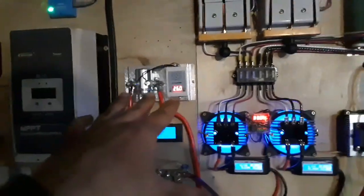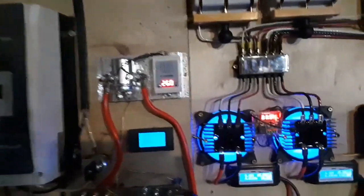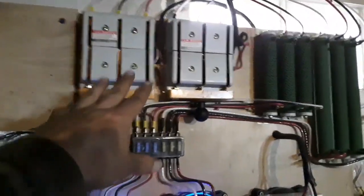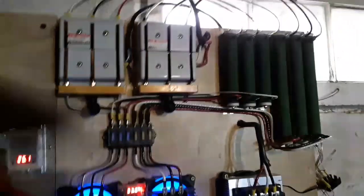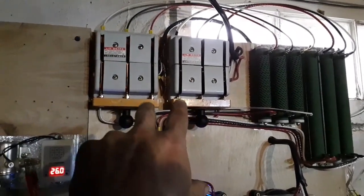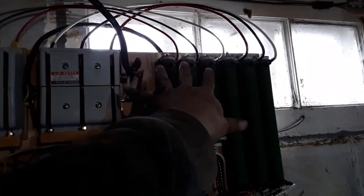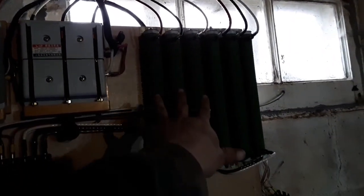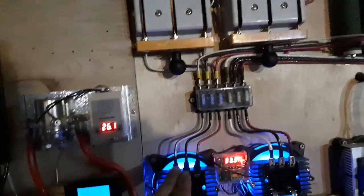And this is more for when I'm away from home, up north, because when I'm home, I can come use this system, which I built in originally. This is John Daniel's design. It's the fly and brake design. So you flip the switch up and it reroutes the three phase from the turbines through three resistors back to the fuses and to the rectifiers.